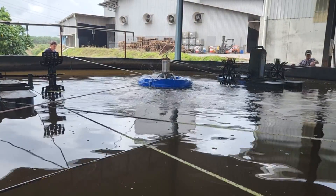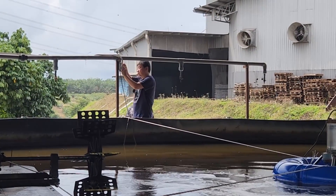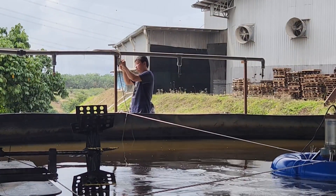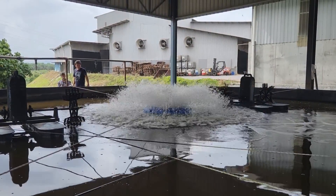We tried to turn it on but there was something wrong with the connection — most likely because the power lines were inverted and the direction was wrong. What we had to do was make an electrical modification and swap one of the lines, L1 and L2 mainly. Once you turn it on after that fix, this is how it should look.